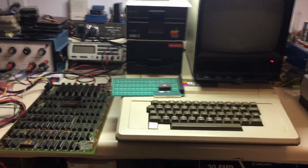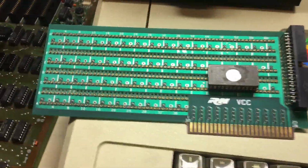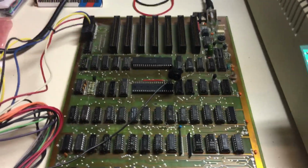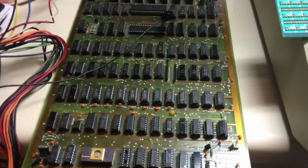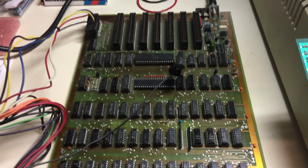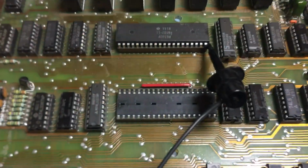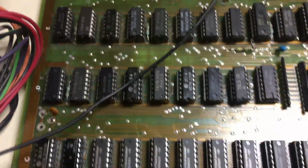If you remember in the last episode, I had found my wonderful prototyping card for the Apple II, and I was trying to figure out how to boot up this West PC motherboard, which I have figured out now. Some interesting details about these: they were clone motherboards made in Taiwan, and they were used by various clone manufacturers, including West PC. This was known as the GTAC2 motherboard style because it also had the Z80 processor next to the 6502, which I've currently removed because I was debugging. Now, I did run into some problems.